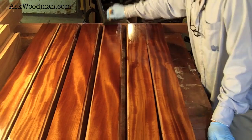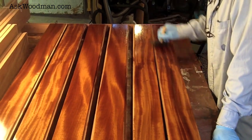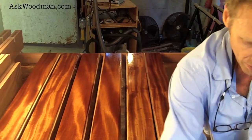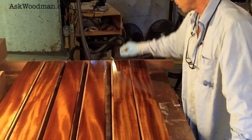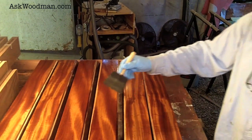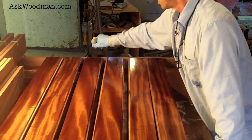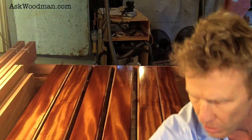One of the ways I first learned about this is I had a retail space when I first started selling furniture to the public, where there were a lot of antique dealers. They kept talking about this finish because it was the antique dealers' secret — you could clean an old piece of furniture with soap and water, let it dry, put a coat of Waterlox on it, and not really alter the look of the piece at all.